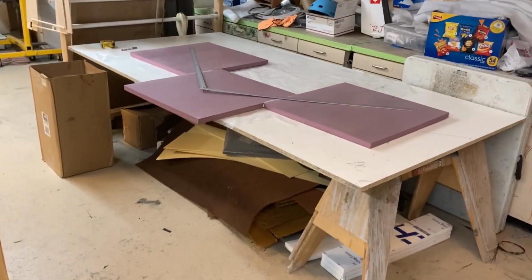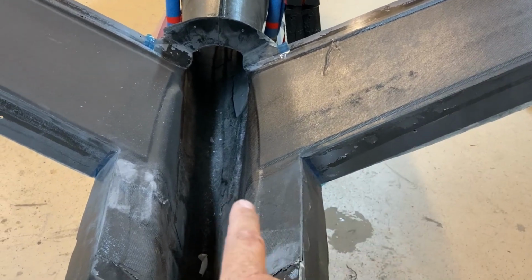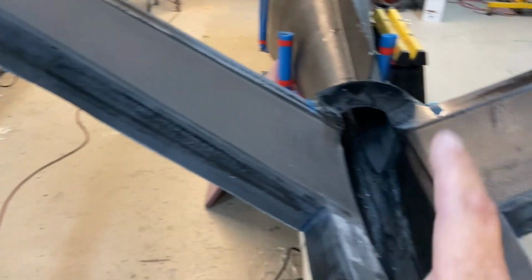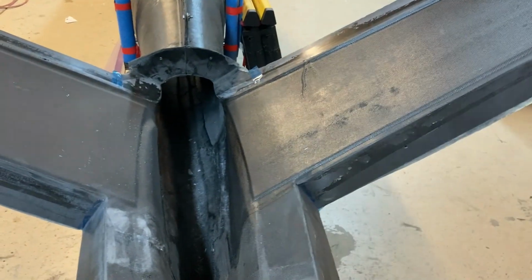I'm gonna start tracing out my angles on there, get that fit. And what I do is I'll get the bottom part fit here against the bottom skin, and get the fuselage part fit in here, and I'll leave it tall. And then I will start bringing over the top mold and take some measurements in between and start basically sanding that down until it's a really nice fit.